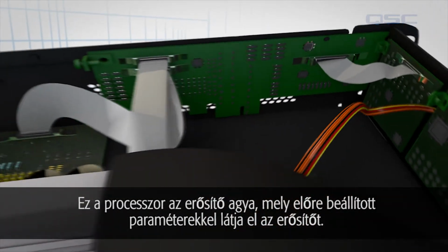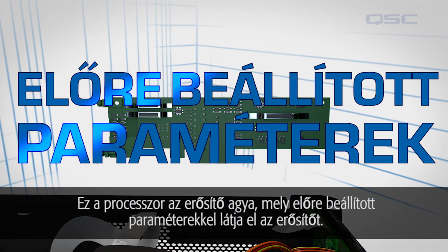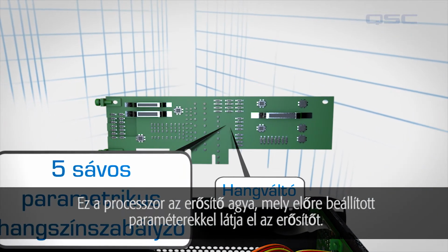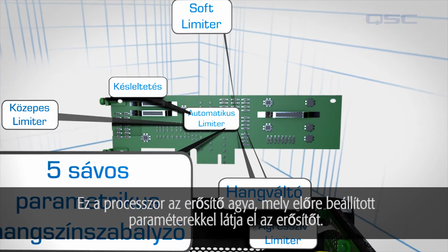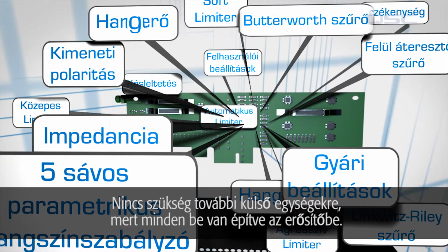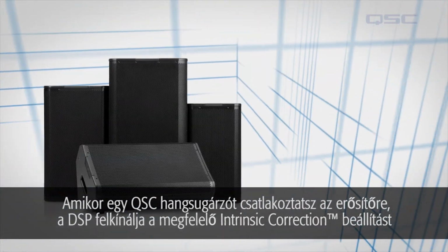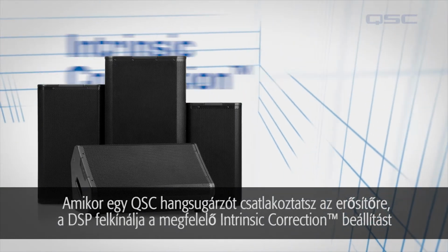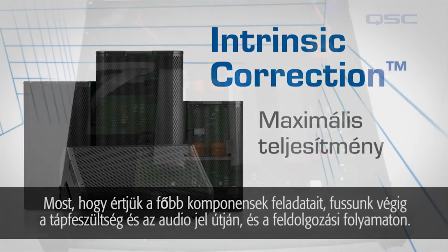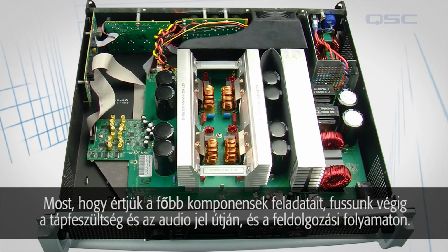The brain of the amplifier is this processor, which provides real useful DSP to the amplifier. It provides all of the essential processing, like crossover, 5-band EQ, delay, peak limiters, and more. There's no need for an additional external device because all of these functions are built into the amplifier. And when connected to QSC loudspeakers, the DSP board offers powerful intrinsic correction processing that will maximize their sonic performance. Now that we understand the major components, let's run through the power, audio signal, and processing flow.